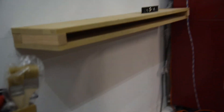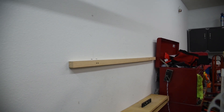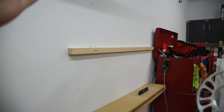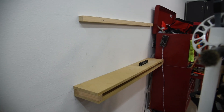One shelf is up and as you can see, nothing underneath it holding it up, nothing on top — just inside. Doing the same thing for the second shelf here. Basically the same principle: I just bolt the two-by-two to those spots I marked where the boards are behind the wall, and then I bolt it up.